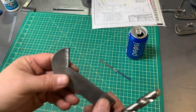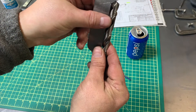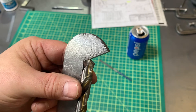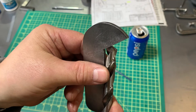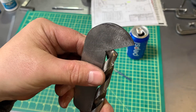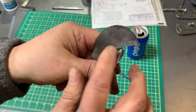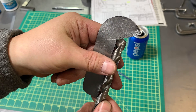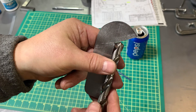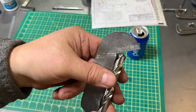I've got a 15/32nd bit out of my box and this is basically what you've got. So if you're working on a 118-degree bit, this is what you're going to get — it's nice and straight. What happens is when you grind one side, you can come back, turn the bit over to the other side, and see if you've got the same distance to keep it even. That's pretty important — you've got to have that point right in the middle.